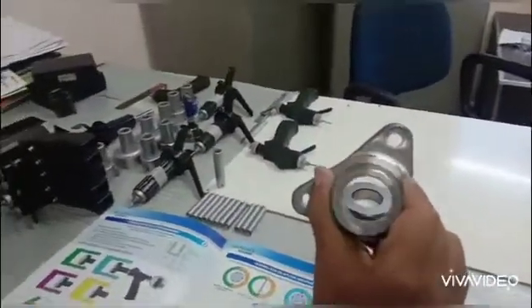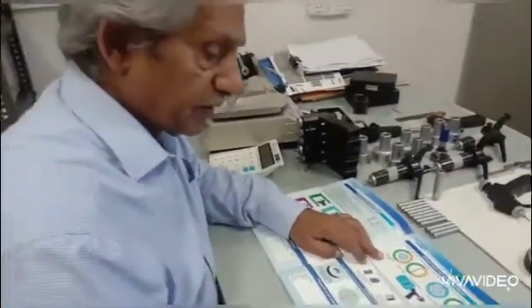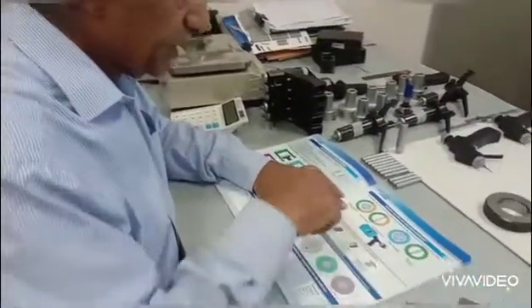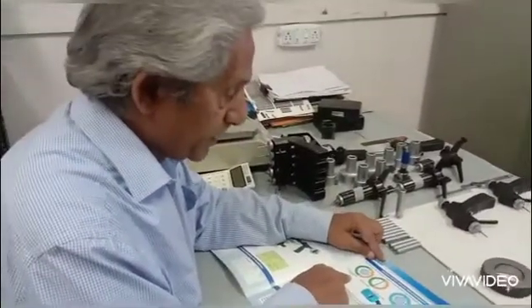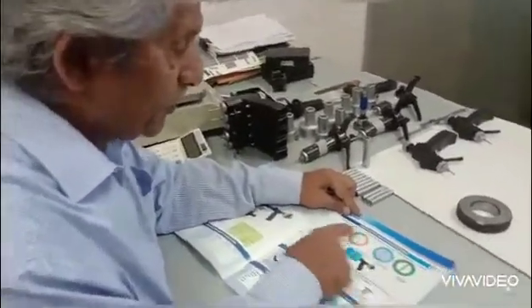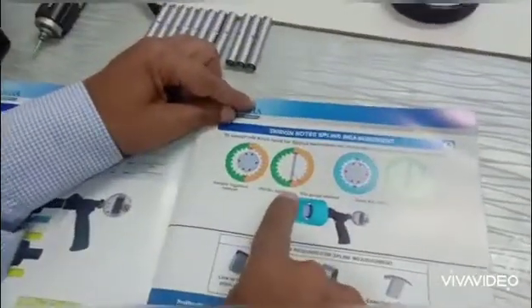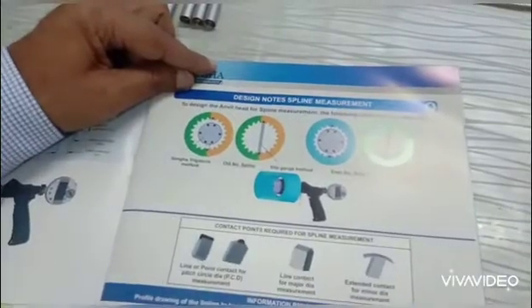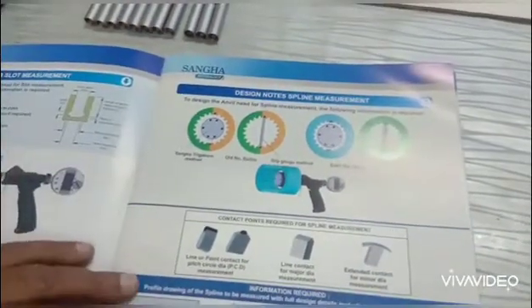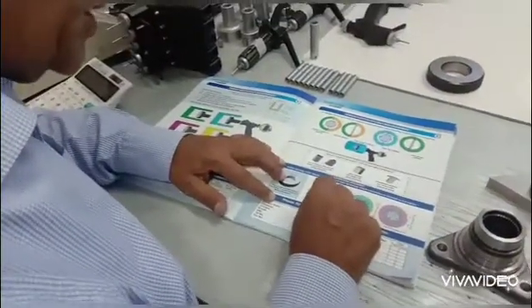This is basically a spline of a certain pitch size, but it has an odd number of splines. Normally the only way of measuring these is using slip gauges, which is a very laborious and highly skilled operation. In this case, what we are going to measure is, just like with slip gauges, the size between the best wire sizes.